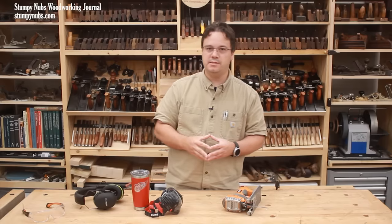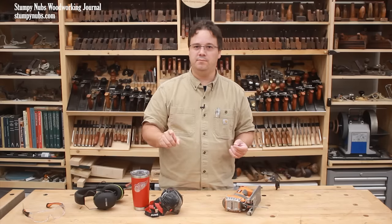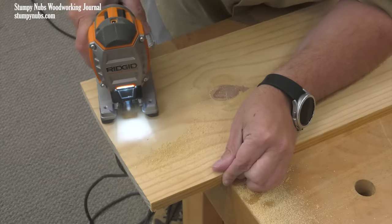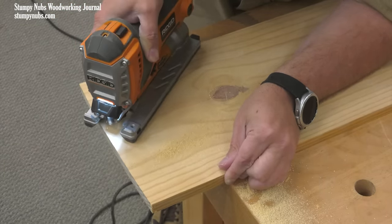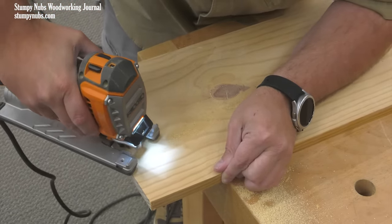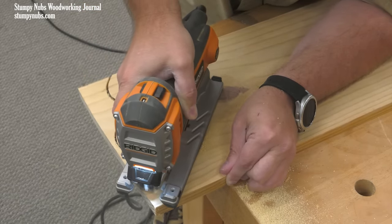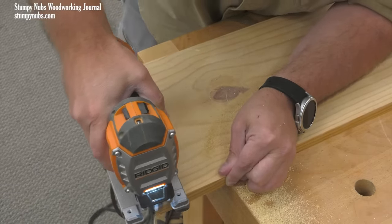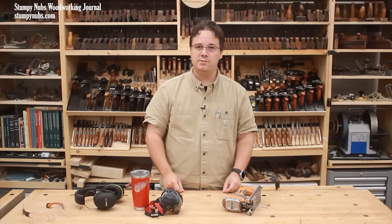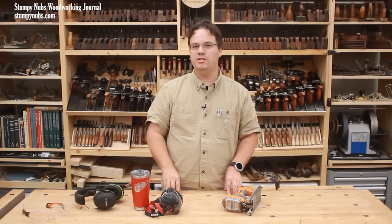As far as the number of teeth on the blade is concerned, generally the fewer the teeth, the faster the blade will cut, but the rougher the result may be. For thick material such as a 2x4, you need a blade that removes wood efficiently or you'll generate a lot of blade-dulling heat — around 6 teeth per inch is best for thick materials. Ten teeth per inch is a good all-purpose blade if you cut mostly three-quarter inch stock. For thin materials like three-eighths inch, look for something finer. For very dense materials such as acrylics and metals, around 24 teeth per inch is a good range.